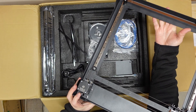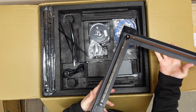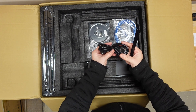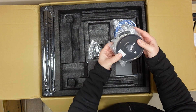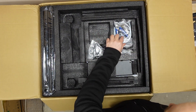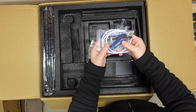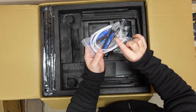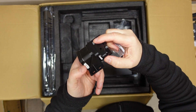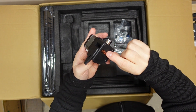Those two stepper motors are not bigger than those on an Ender 3 or something like that — I think they are just regular NEMA 17 stepper motors. Here are some plastic covers, the power cable with a UK plug, sample filament on a spool which I'm happy about — 200 gram PETG. USB cable, small SD card with USB adapter, Bowden tube, tools, zip ties, Allen keys, spare nozzle. This is the BMG extruder with dual gear. It has a gear reduction but I'm not happy with the plastic gear — I'm happier when it's metallic.